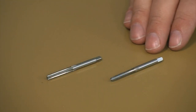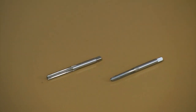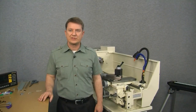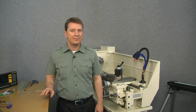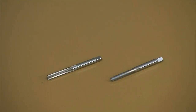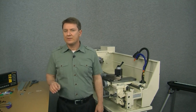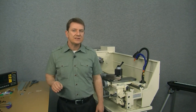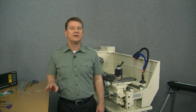If you look closely at the tap end, you can see a plug tap is tapered at the end, where the bottom tap is square and not nearly as tapered towards the end. This is because the bottom tap is threaded almost all the way to the end, as it's designed to tap the very bottom threads of a hole. The taper on a plug tap is important because it's easier to start threads with, and perhaps more importantly, because of its taper it's also easier to control what angle the threads first start at. It's imperative to make sure the tap starts threading at exactly the same angle as you drilled your pilot hole — having a tap break because it didn't go in at the same angle is not a fun experience.